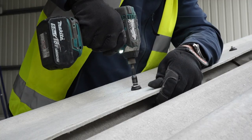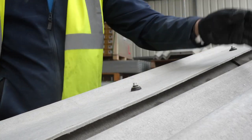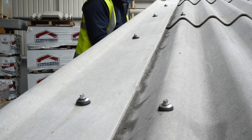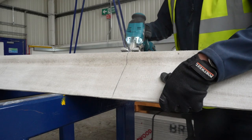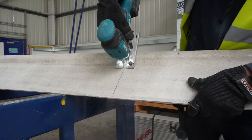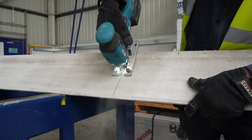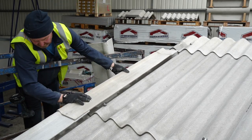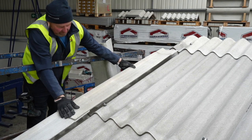As with all fiber cement products, the fixing holes must be 2 millimeters oversized to allow for expansion, unless using self-drilling fixings such as tek screws. If necessary, you can cut the barge board into smaller lengths. On plain wing barge boards you can cut any side of the straight piece; however, if it is a roll top or verge line, you can only cut the side of the barge board which is not socketed.